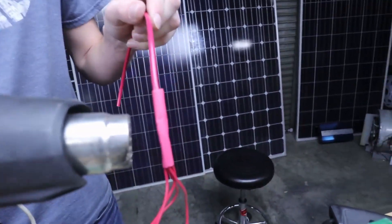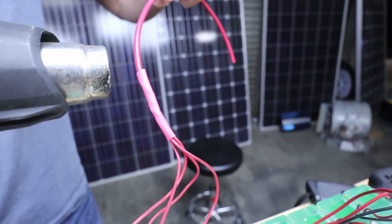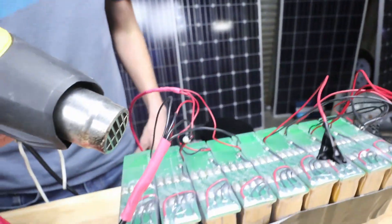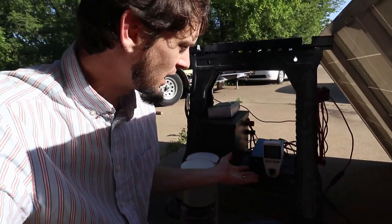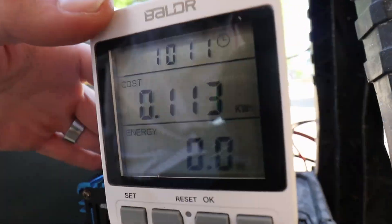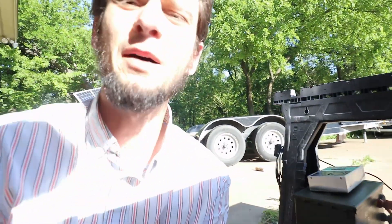With this inverter's higher voltage cutout, we set our charge controller to 16 volts. It charges the batteries up to 16 volts, and the inverter can handle up to 16 volts, so it doesn't hit the cutout. We've now finished our pot of coffee. Can we run the coffee maker? Yes — a 1000-watt inverter will run our 860-watt coffee maker load just fine, for the whole pot. The meter shows 113 watt hours used for a ten-cup pot of coffee.